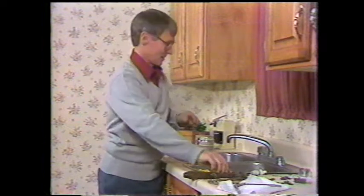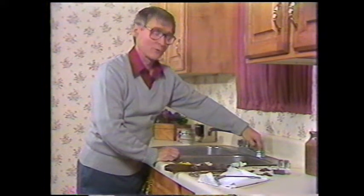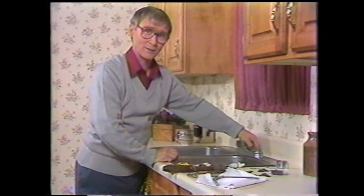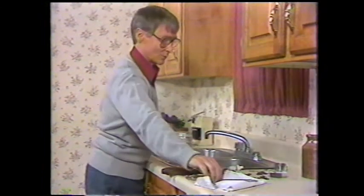Now, before we put it back in place, there's another area that you should look at, and that'll be the seat. And the seat is inside the tap. If you run your finger around the inside of this tap, you'll find that it may be smooth, it may be rough, it may be cracked, in which case it's time to replace it.